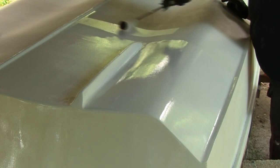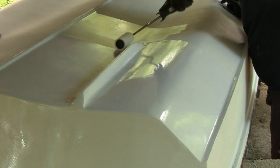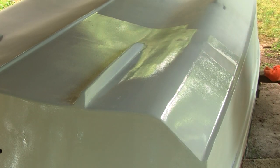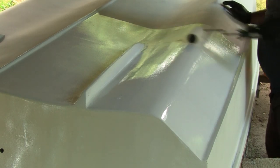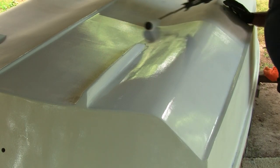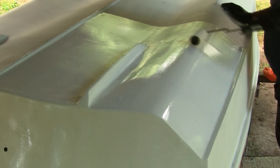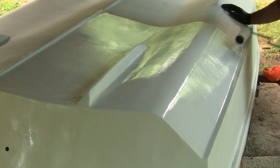This is the Russell Brown technique: roll out a roller full about two lengths away from where the wet edge is, then roll it out getting it as even as possible. I loaded up the roller with a little more paint, trying to get this as even as possible. Once the paint is spread out as evenly as you can, roll over it lightly so you don't leave any lines behind - basically just the weight of the roller going over those overlapping lines to flatten them out.